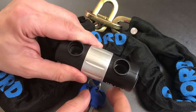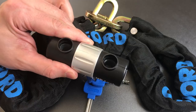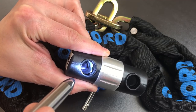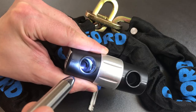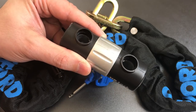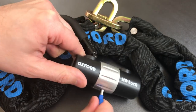There's also something in the construction of this lock that I don't see on even much more expensive locks. Inside of all this — I think you can see it now, but let me get a light — we have a metal construction. I believe it's cast zinc on the inside, though it may be aluminum. On even some more expensive locks, what you'll see is plastic on the inside of the hardened steel tube. So that's a really nice feature to see.